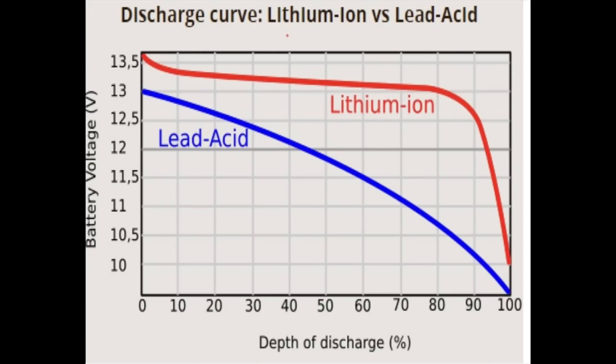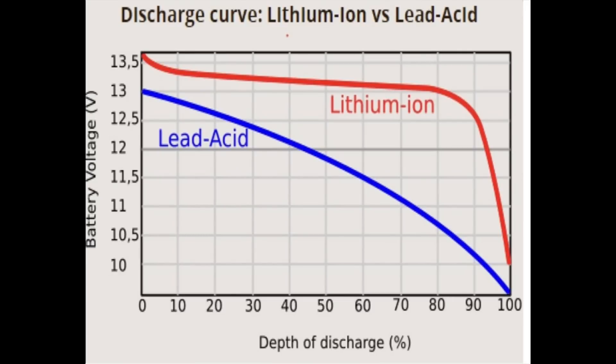Price and convenience are all very well, but the most important thing is how well it actually works. This is where LiFePO4 batteries come into their own. Compared to lead-acid batteries, which degrade steadily, LiFePO4 batteries hold their charge at a much higher voltage for far longer. With lead-acid, once you get down to about 12 volts you should stop using it — deep-cycling repeatedly kills it. With LiFePO4, it keeps its charge right to the end and drops off like a cliff just before it empties.